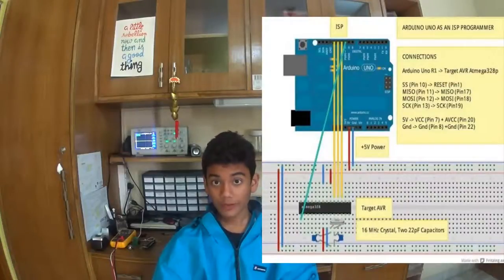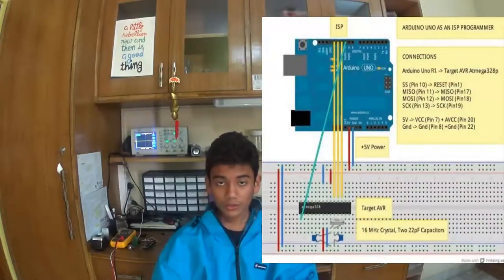There are a few reasons why you would like to use it. First, it's low cost — not very expensive and it's versatile. And second, it's exactly pin-to-pin compatible with the Mega 328 chip from most of these boards, so it will make designing a hell lot easier. So once you've chosen an appropriate microcontroller, then you have to connect it with the Arduino as shown in the figure here. Let's build up the circuit and have a shot.